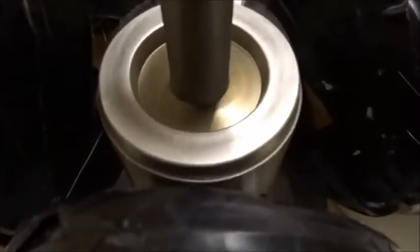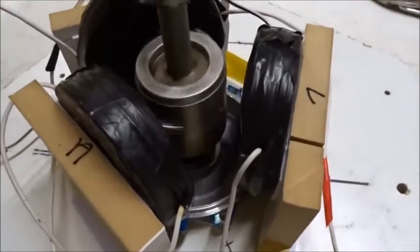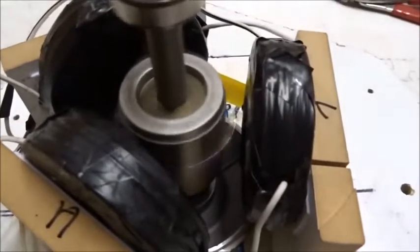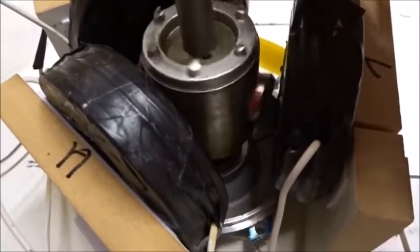Beautiful, isn't it? So there's absolutely no trouble having our own little coils instead of the one from the machine, to study further. When we add a simple magnetic dipole on the magnetic rotor — like a bar magnet in the middle — it spins quite nicely at 5 hertz rather than 10. So we're clearly getting a lot more power just by having a little magnetic dipole on the rotor, with a north out there and a south out there.